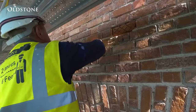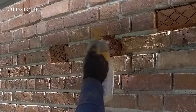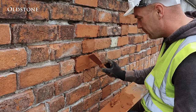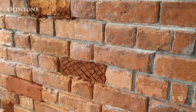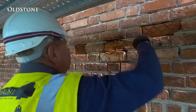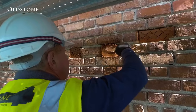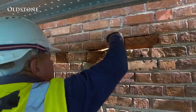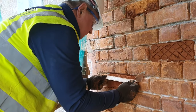If the depth of repair to be applied exceeds 30mm, it is applied in layers, with each surface layer moistened, mortar applied and then the brick surfaces scored or keyed, which helps the next layer of mortar to adhere to the surface as you build up each of the layers. The mortar is applied on the final layer and left slightly proud of the surrounding brick for it to stiffen. Once sufficiently stiff, the excess mortar is scraped back and shaped as required.